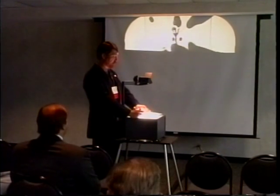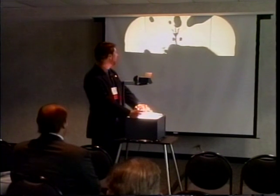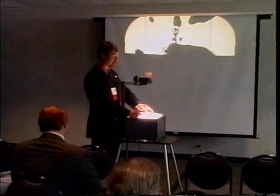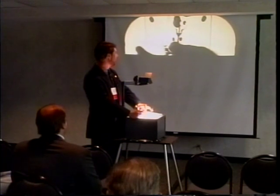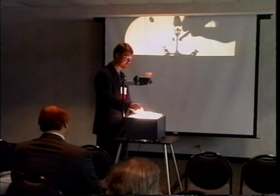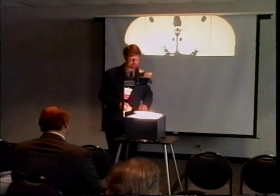Then we turn the balance wheel 90 degrees and we feel for clearance, which that's pretty tight. 90 degrees on the other side, and we feel for that to be equal. I'm going to go ahead and open that just a little bit more so you can actually see the space. Equal amount on both sides.